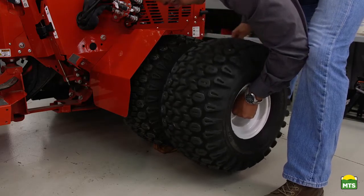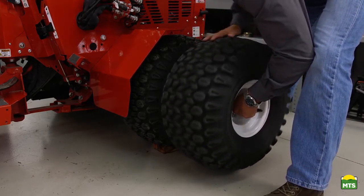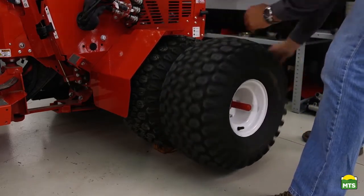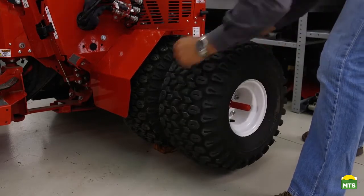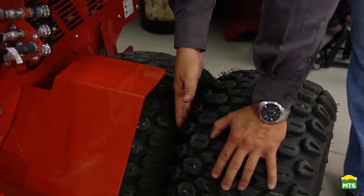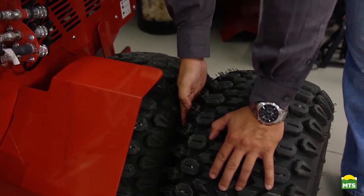At this point, we want to install our outer wheel assembly to our inner hub. Hold the draw bolt and place the threads of the axle extension inside the inner hub and then spin the tire clockwise until it is hand tight. You should have approximately 1/2 of an inch gap between your inner and outer tires.